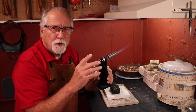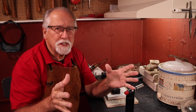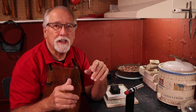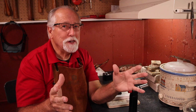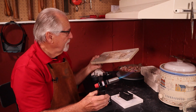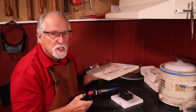I'm going to stop at this point. This next step is the most important step in the entire annealing process, and almost everyone either is unaware or ignores it. And that is light. If you anneal your silver under your normal studio lights, you are guaranteed to overheat the silver. Turn off or turn down your studio lights. If that is not possible, anneal in a dark corner or use a soldering shield to block as much light as possible.